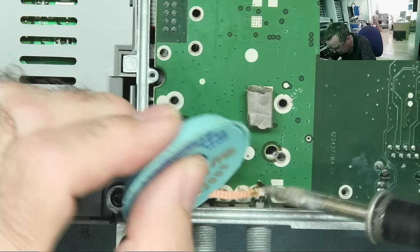So same thing again. Yeah, you see how it's moved now. This end. Okay. And then I can probably just heat both pins together and pull it out. Yeah. Okay. So white stripe negative goes to the negative. This isn't a wire or something that's pulled out. It's just a solder. Yeah. Okay. Still some on there. That's what it is. It's just solder. Okay. Clean this up.